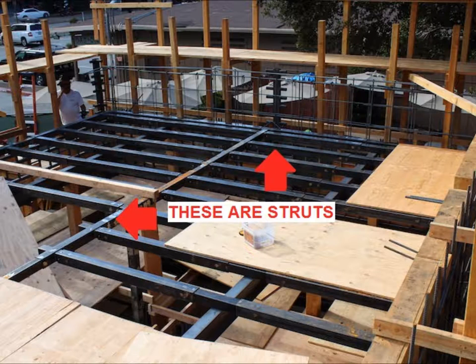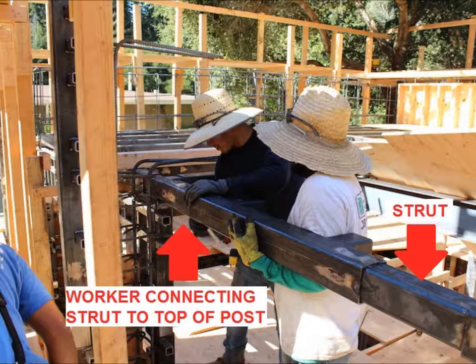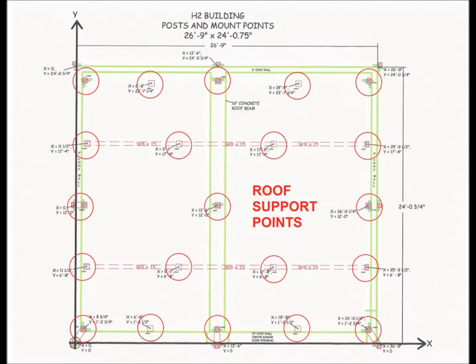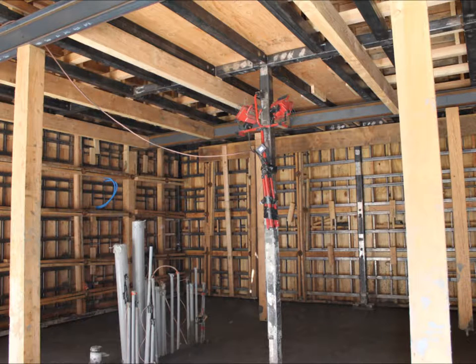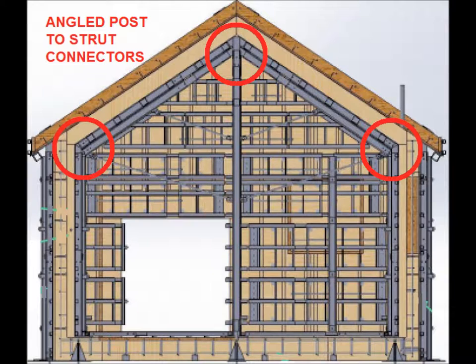After we close up the lower walls, we move our attention to the roof form, which must carry the 56,000 pounds of concrete and steel. This is done using a framework of steel tubes that are buttressed with I-beams. These struts that comprise the roof form connect into the top of the posts that serve as the inner wall form. Struts mount using larger stubs and have drive screws that make them adjustable like the frames and posts. There are 23 support points for the roof form, and these support points also serve to buttress the wall forms. This building has a flat roof, but by using angled connectors from the posts to the roof form, pitch roofs can be formed using the same struts.